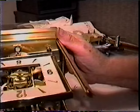the balance pipe. Now underneath here is another screw with the channel in it. Unscrew it, loosen it up, unscrew it out carefully. Don't be too much in a hurry when you're working on this clock, and just slide the suspension out. And the regulator came with it.